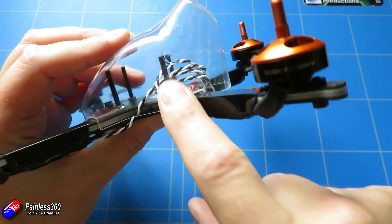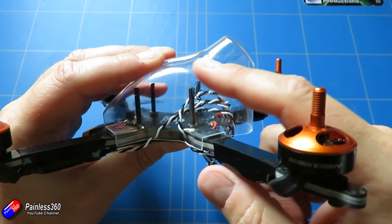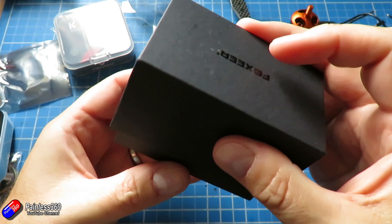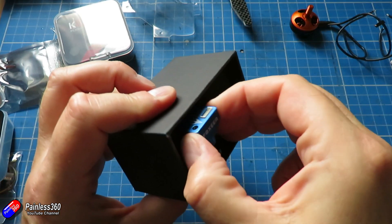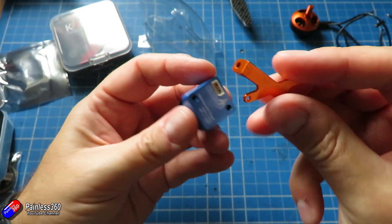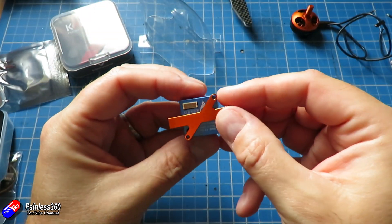For the camera, you need to think about the camera type. Ideally you want the connector for the camera coming out the top, though it can come out of either side. Some pilots look for cameras where you can flip the image. I might use one of these Foxeer cameras — these are the new ones I'm testing and they're a nice size. I might end up sticking a Runcam on instead. The actual bracket is designed to screw into the back of a camera, but you can also use double-sided foam to mount the camera if the holes don't line up.